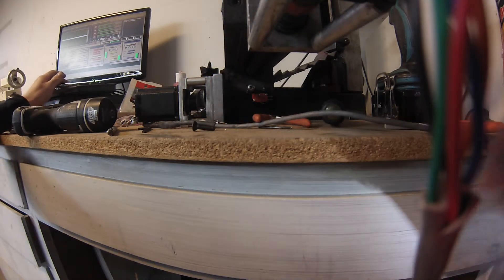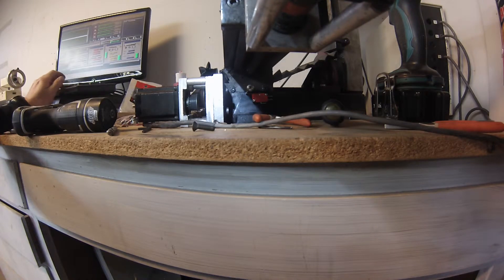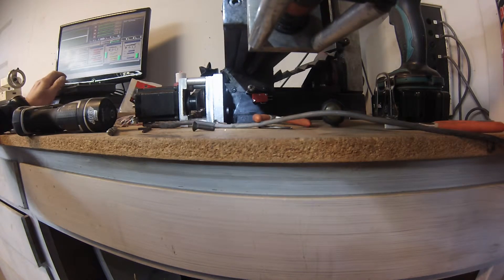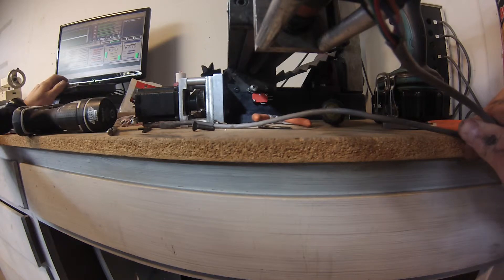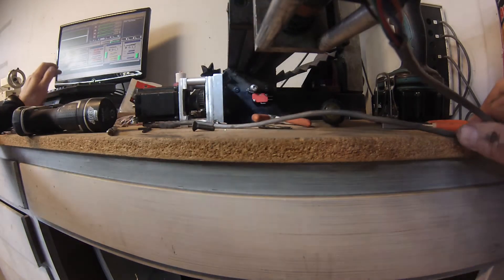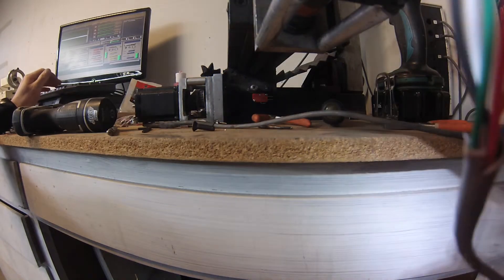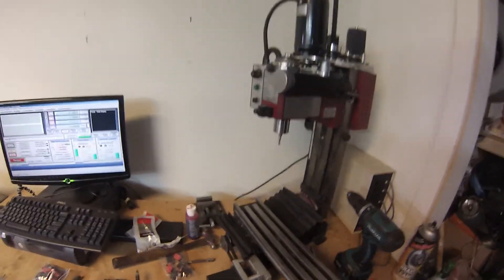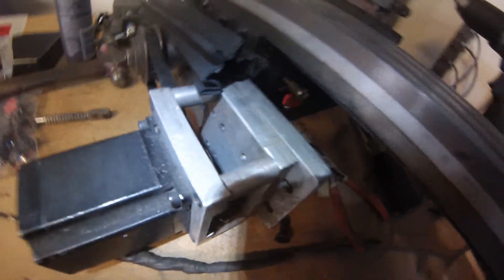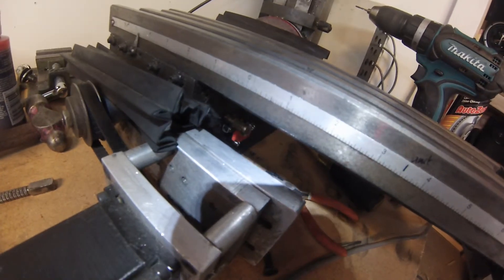Click — we got it to click. Now I'm gonna test how much clearance we have. Quite a bit — good. I just wanted to make sure it wasn't clicking right at the last second where there's a chance you could mechanically stop before it hits the limit switch. You can get real close with the switches and then make a small adjustment on the arm if you need. That's how I'm gonna set this up — should be just fine.